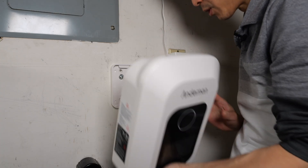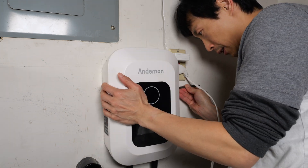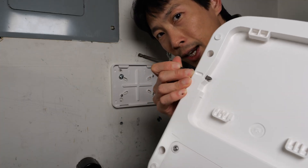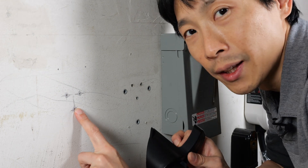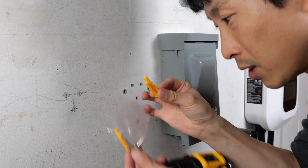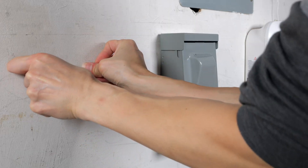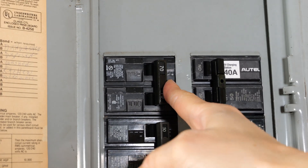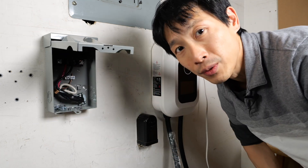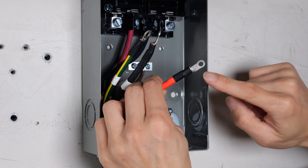This is the locking mechanism — just slide it right on. If you want to release it, push on that lever and it comes back off. Cable holder with three screws. I'm reusing this screw hole right here just to minimize the holes. These three anchors look more reasonable for fitting in this drywall. Turn off the breaker — this is wired up to my main panel through a 70 amp breaker, just the box, and there's 240 volts coming out. I have this type of post that doesn't fit in there; I need a ferrule instead, and we can do that with this crimp kit.